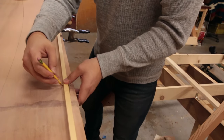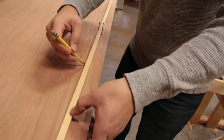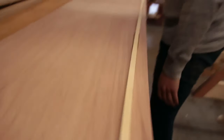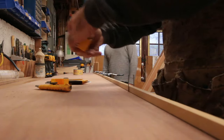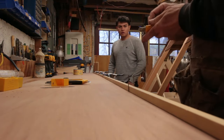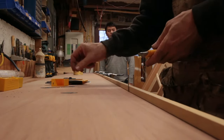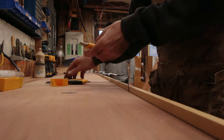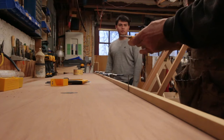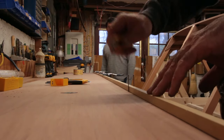Accuracy and craftsmanship comes down to the little tiny details you employ along the way. We're actually going to score this line as well. The reason for that is because we're going to use a circular saw to do this cut. It's pretty darned straight - maybe we'll do it on a table saw even. This is something you don't generally do - use a table saw freehand - but if your curve isn't too drastic, it's actually a really nice way to cut a line. Sometimes you can get grain breaking out, so a nice way to undermine that is by just scoring it with a knife.